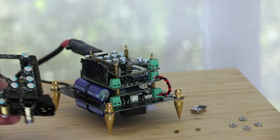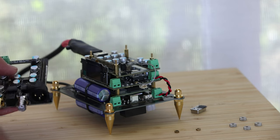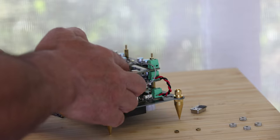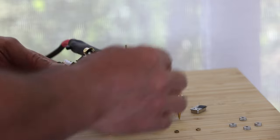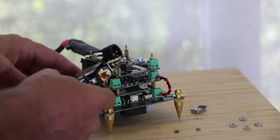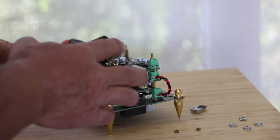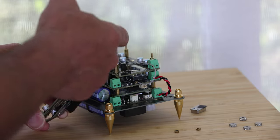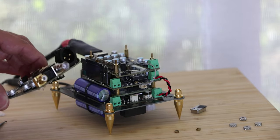Before I carry on with the upgrade: I got a lot of questions like 'my DAC doesn't take I2S.' You don't have to worry if you don't have I2S — instead of the HDMI Pro board, you're going to use what we call the Transport Pi AES. This one has all your traditional outputs and you can use that board instead. They're about the same price, but I would not use both — don't introduce more noise.